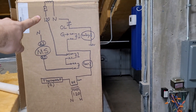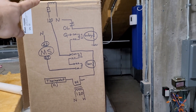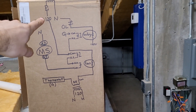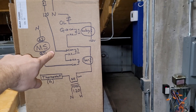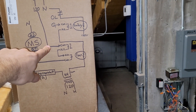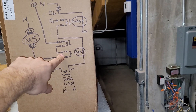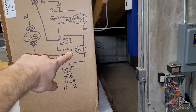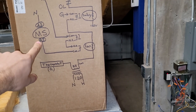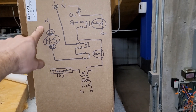Here's what this circuit looks like on paper. We have the transformer in the motor starter which is taking in 480 volts and stepping it down to 120. That 120 comes down to one of the poles of the safety relay, and if the safety relay is energized it is fed through to the pole of the fan relay. When the fan relay is called it will supply that 120 volts to the motor starter coil, and on the other side of the motor starter coil you have neutral.